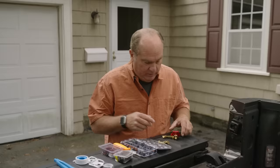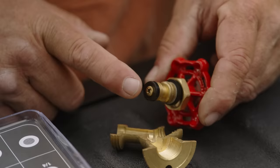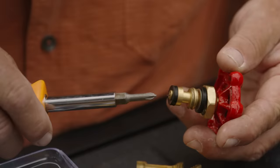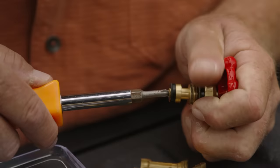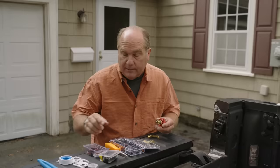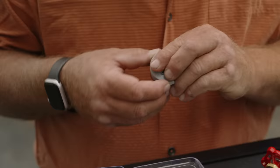They make kits with every kind of size washer you'd need. There's a variety of different kits you might get and you really need to find the correct washer. The hardest part is to get this screw out — it's been sitting in water its entire life. So you want to take, in this case, a Phillips screwdriver head, make your connection to it, and then back it out. If you snap this off, you're going to have to re-tap it or get a whole new unit. But once you take it off, put the new one in and put it back together again.